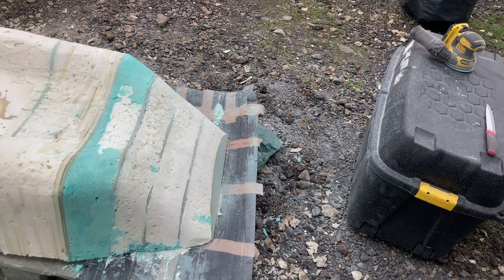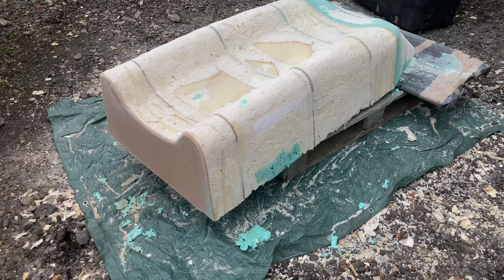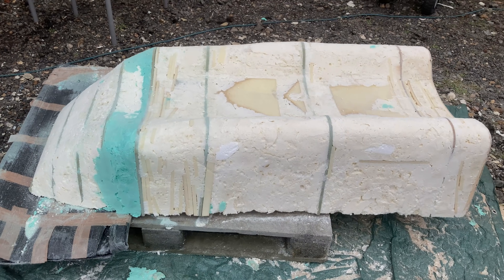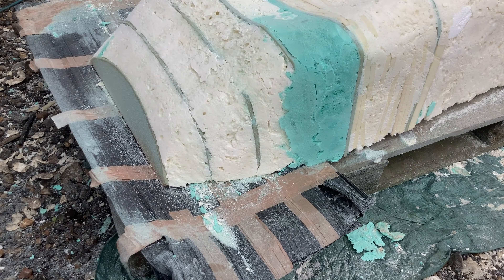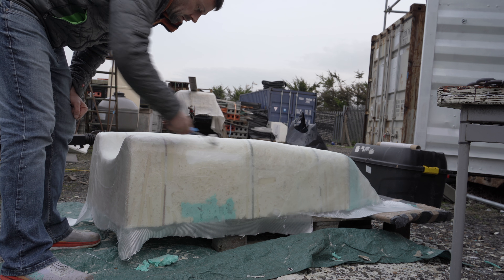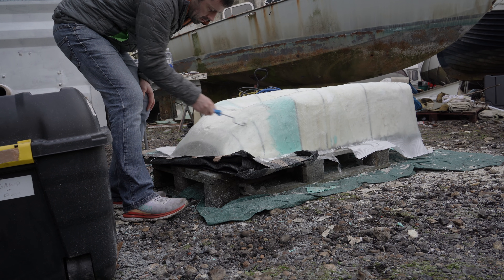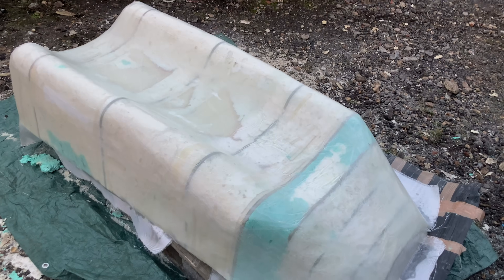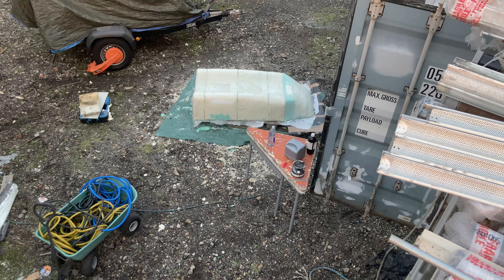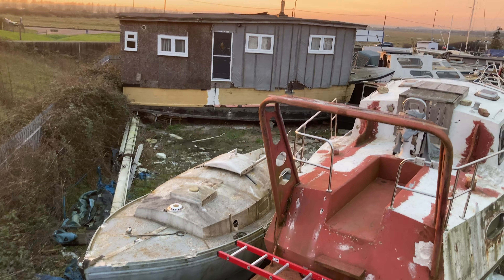The name of the game here is low cost — I want this plug, or pattern, or male mould, or positive mould to cost me less than 100 pounds. You may be able to guess why when you consider this is only a one-third scale of the real thing. I attached the nose with some more expensive Soudal 2K chemical-cure foam with better adhesion, and orbital-sanded the whole thing down to a reasonable finish. Then rather than filler or fairing compound, I wrapped it in shrink wrap and did a skin over the top of glass fibre in some expiring epoxy resin. My hope is that this will give me a functioning mould from which to create a part — yes, direct from the pattern. I'll cover why, and all the shape and size choices behind the prototype, in the next video where I actually do the proper lamination.